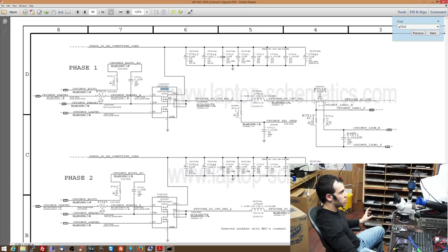So as I've said, think of a transistor like a variable resistor, like a resistor whose resistance you can change depending on what you tell it. So based on the signals going to this gate and this gate, that transistor and that little transistor in there will decide to open. And the way this works is they open and close, open and close, open and close.